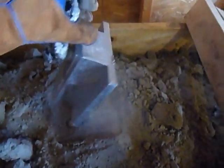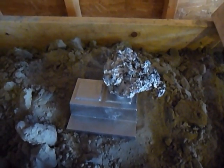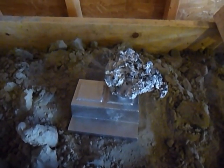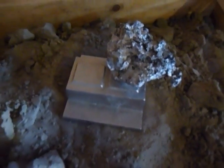As you can see there is a huge thing on the top here. I was finishing the pour and that big chunk of stuff just came out of the bottom of the crucible, so it's probably just slag or dross or something. It wasn't very fluid — it just kind of plopped out. I'm not sure why it was sitting at the bottom there; maybe I need a flux or something. But anyways this came out really well. It pretty much matches the pattern, and you can definitely see some of the pattern defects a lot better when it's in metal. But overall it looks really good.